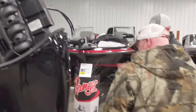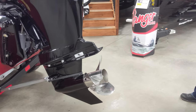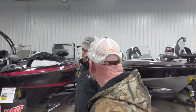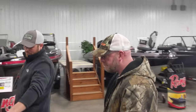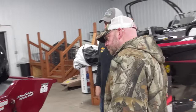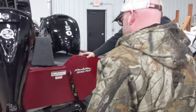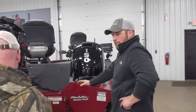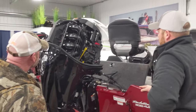For the impeller, you've got to drop the lower unit. Have you ever done that on a motor before? I haven't, but a friend of mine has. It's the same process on this 150 as it is on a 15-horse — you drop the lower unit down, the drive shaft comes out, and the impeller is connected right there. There are tons of really good YouTube videos showing how to do it if you plan to do it yourself.